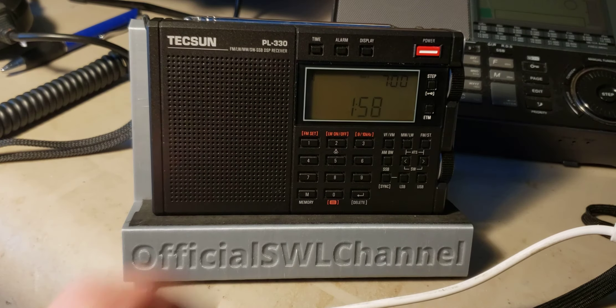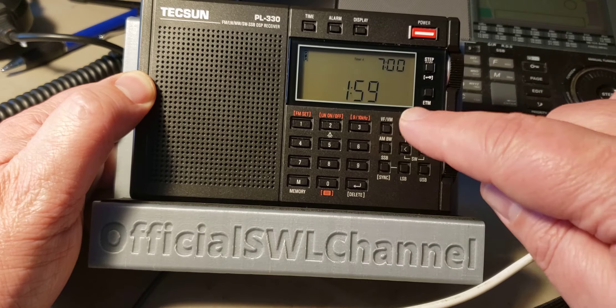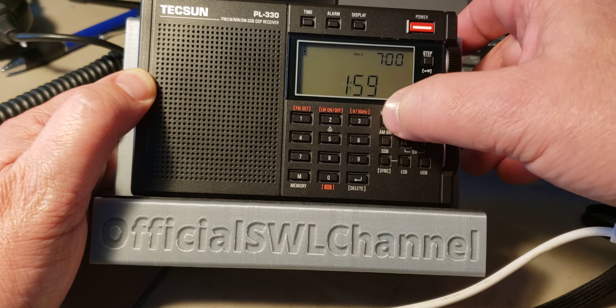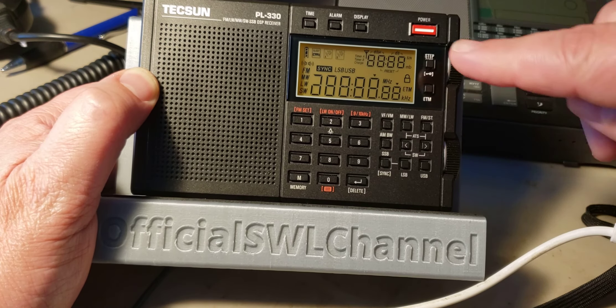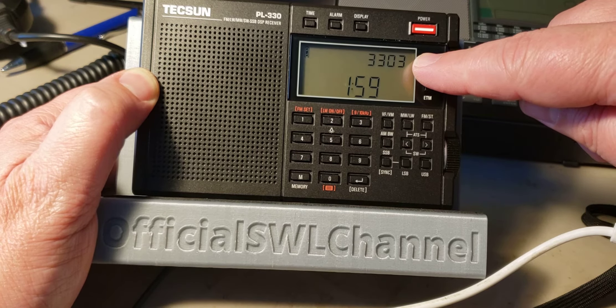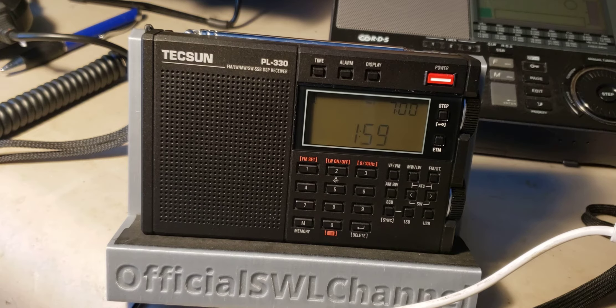This one is the Chinese version — my firmware has the SSB reverse tuning bug. But if you want to know what version you have, you have a button here called VFVM. With the radio off, press and hold until all the segments in the display are lit, then let go. Give it a little bit of time. On the upper right, you will see a number — that's the firmware version. 3303 is my firmware version, just before the clock gets back. That's how you verify your firmware version.